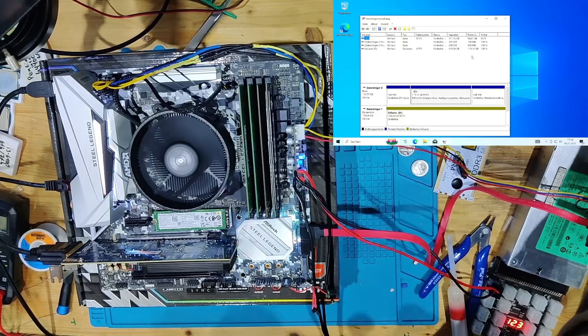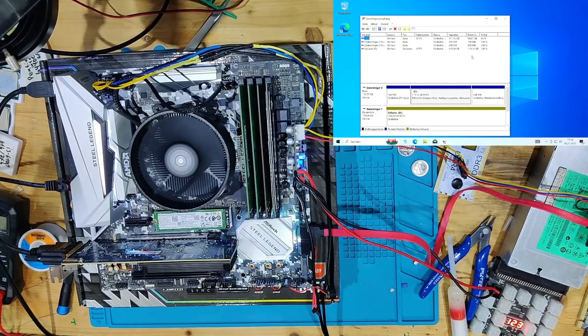The problem was physical damage. I'm not too sure if it was only the physical damage why the customer gave this to me, or if there was something else, a stuck BIOS or anything, that he had a no boot and then when disassembling did that. Because he said it turned off while being in normal use and never turned on again. But who knows? That is only his story. We got this fixed. We knocked off a resistor. I flashed a BIOS on this board, so we have the newest BIOS on here.